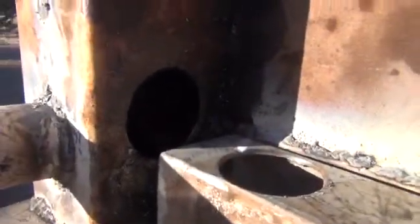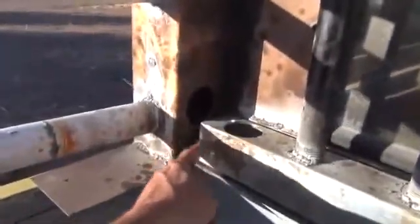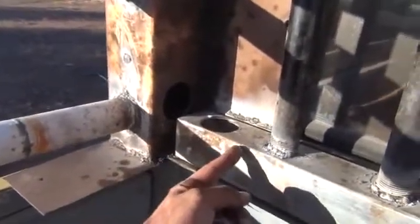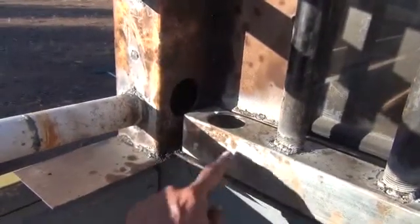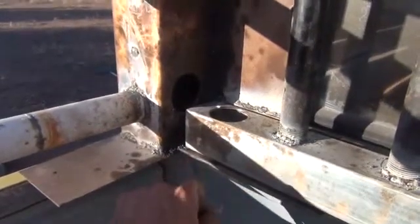Let me carefully walk up here because it's just kind of resting there. What I've done is hole sawed a two inch hole in the bottom of that, right where our gas is going to come out the bottom of our radiator on the side there. Gas is going to come in the top, work its way down out the bottom. It's going to come out into this piece of square stock — I'm going to pull that up and weld it into place. Right here in the square stock is a baffle inside of there, but this one is just straight up and down. That does have a slight little gap at the bottom just so anything that condensates in here can get all the way through the system. Very little gap — you don't want your smoke going through.